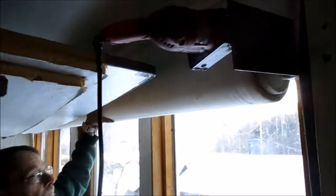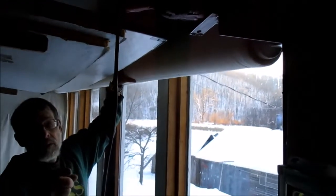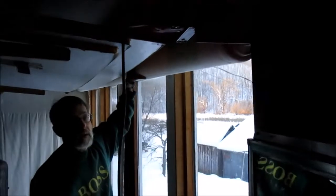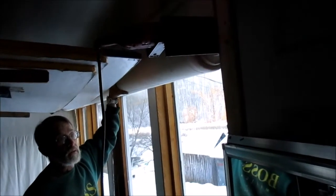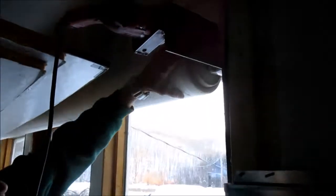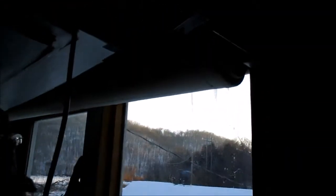This is real heavy warm window systems insulated curtain material that we bought at Hancock Fabrics. It was fairly expensive — even on sale, enough to do this wall and the one over there, which is 16 by 8, was about $240 for the fabric. That was the most expensive part; everything else I made. It's rolled up on 4-inch diameter heavy gauge PVC and I use an electric drill to raise it up and down.